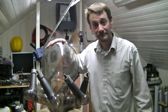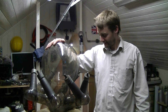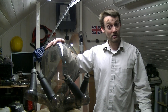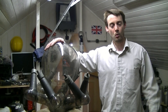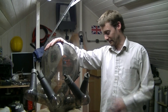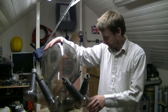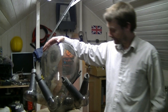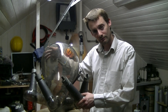Mercury arc rectifier, hundred years old and this thing can probably power a train. Converts AC to DC, six phase — well it was in them days. Obviously now we use three phase, but if you bring the star points out you've got six wires and that's what this is. It's got a couple of auxiliaries on it to maintain an arc, and there's another little one there just for striking it up on the mercury pool. It's about two kilos of mercury in here so you would not want to spill it.